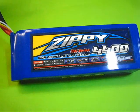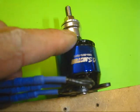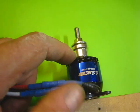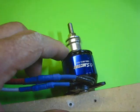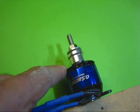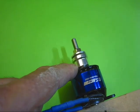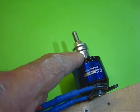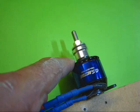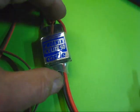Now I'm going to take you through the setup I'm using for my twin — my single is different but I've covered that before. The motors we're using are OS 3815-1000KV motors — these are 1000KV, equivalent to approximately a .30-size motor, very powerful, with a built-in fan and 14-pole construction. You do not want to stick your finger in the prop with one of these running — unlike an IC motor, an electric motor won't stop; it will keep going and draw more power. If you run it at 8,500 RPM, putting on a larger prop will still run at 8,500 RPM but will draw more power and wear the battery down faster.